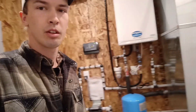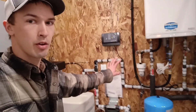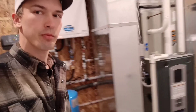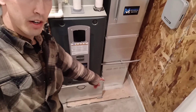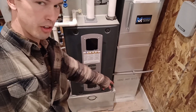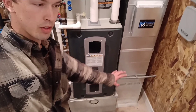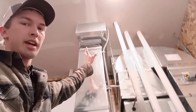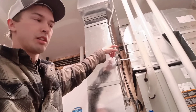That's a tour of this recently completed mechanical room. One final note — just check it out: it's completely finished. We've got sheetrock on these walls because of fire codes, and OSB on these other walls. It creates an awesome surface for mounting things like plumbing lines, well controllers, and all that stuff. Down here there's a little bump out in the foundation, and that's so that we can run a supply and return line down into the crawl space that runs across for the lower zone. And we've got ductwork that punches through this sheetrock up into the attic, shoots across the attic and into the floor system of the second level for the upper zone.